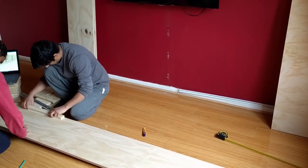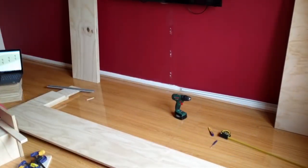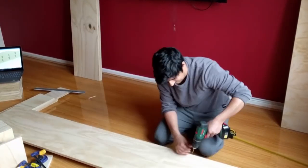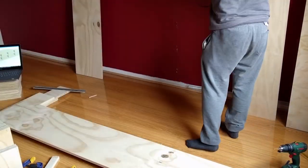I started by marking out the positions of holes for the screws before drilling them and then screwing the pieces together. Because of the width of the room, I designed the storage elements on the sides to be constructed as separate parts to the central part, so that the pieces could all be cut from standard sized plywood boards and transported back to the house.